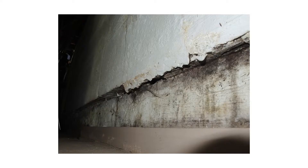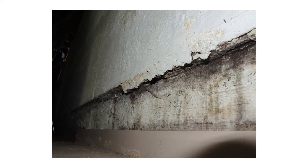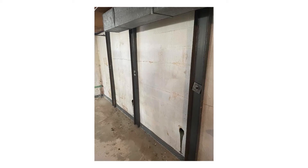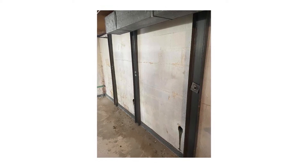What goes into this is number one: the shear. A shear is when a block actually slips on top of another block, so that you get a sharp edge. When we see that shear over about an inch, we have to look at wall anchors as an option. When we do go with wall anchors, we're running steel c-channel from the ceiling all the way down to the footer to hold that wall together as one.